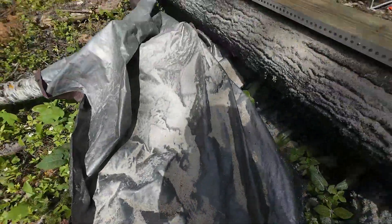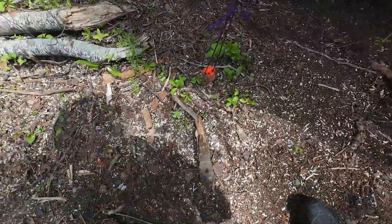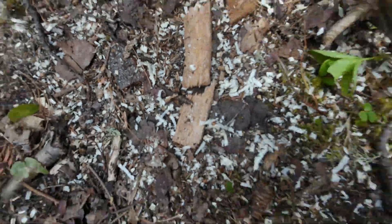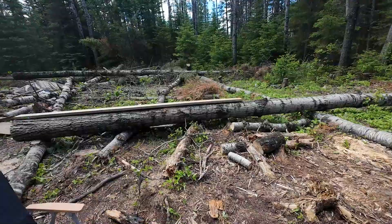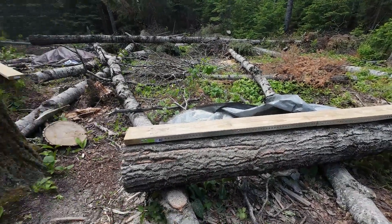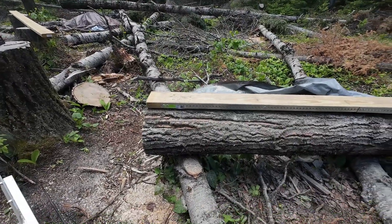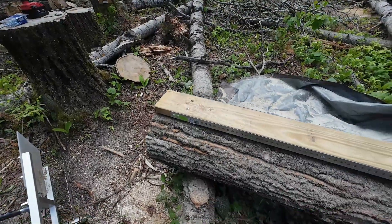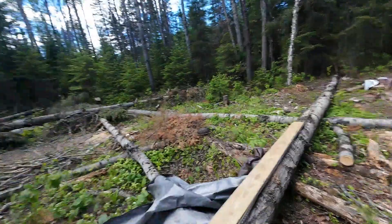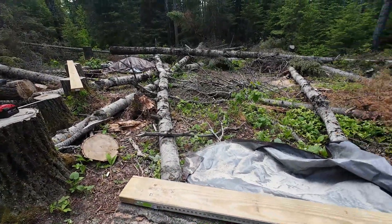It's like nearly powder. They told me they sharpened the chain — I'm not a fan of the sharpening they did. In contrast, over here from the Ryobi you can see nice big chunks coming out. Those big chunks mean that's a sharp chain. So I think the problem I have is chain-related. I'm not going to go any further simply because I'm burning gas — 20 minutes to cut 12 inches is ridiculous. I don't remember having near this much problem when I was milling last year.